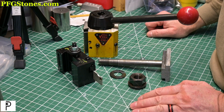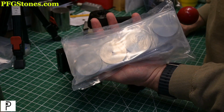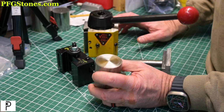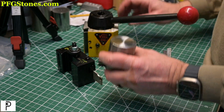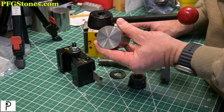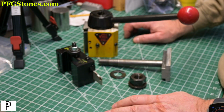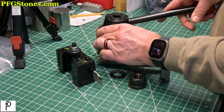So when we were cutting the titanium discs, which are all packaged up and ready for my customer, at the end of the project, when I had already replaced the insert, I started getting some less than ideal cuts. And I started seeing some marks on the face of the part. And what I found was that the tool post had rotated.